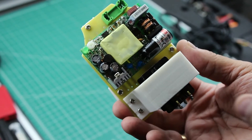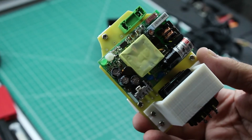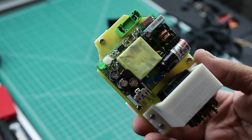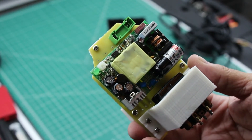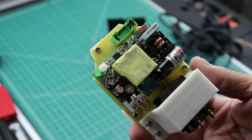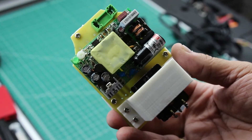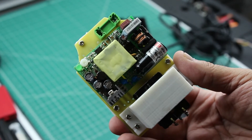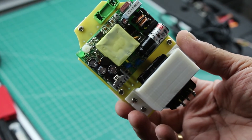The other really cool thing about this power supply is it has an adjustment next to the LED that lets you adjust the output voltage. I'm going to set it a little bit higher than 5 volts at no load, because as soon as you turn the computer on the load will bring the voltage down — that's a nice feature. I wanted to make sure you knew the components I'm using and why, as well as the ratings. The fuse obviously needs to be rated accordingly — I'm going to use a 2 amp fuse.